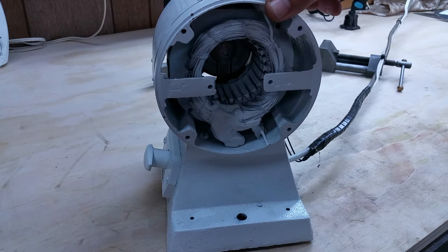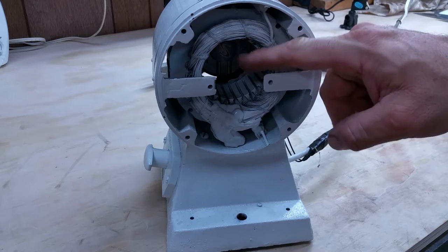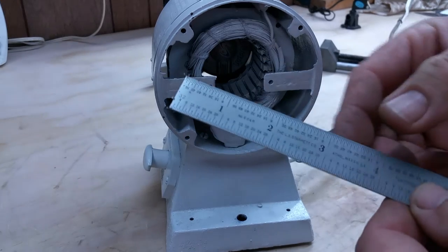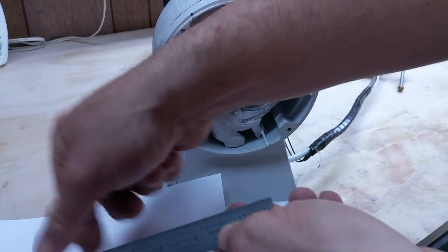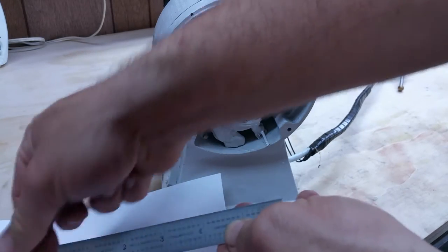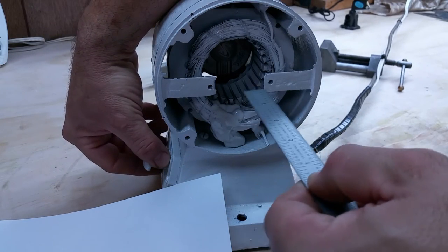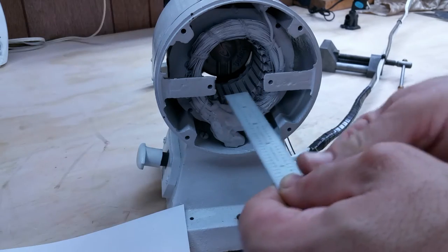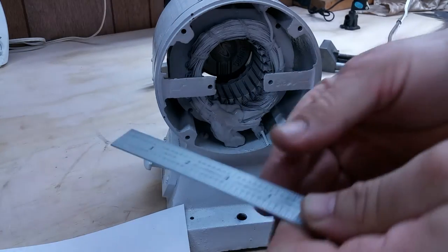This is an old cheap garbage six-inch grinder. We tore it apart and now we just have the motor, but it works perfectly as a demagnetizer and a magnetizer. So here's our steel rule and it's full of chips. We'll collect the chips down here on the paper so we can test it in a minute. We turn the motor on — your duty cycle is maybe 30 seconds or so before it'll start smoking. Turn it on, pull our ruler in, and pull it out slow.